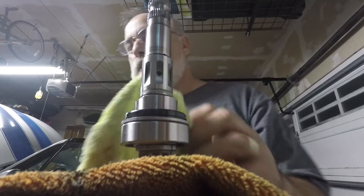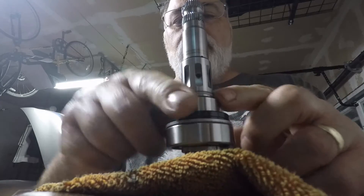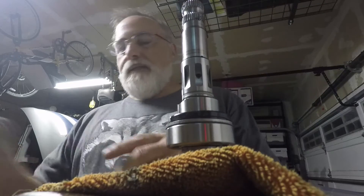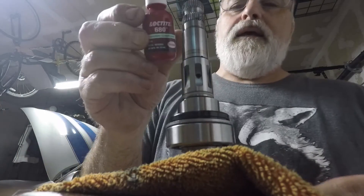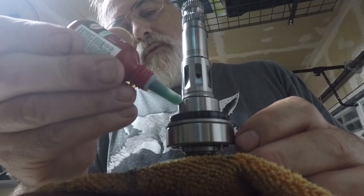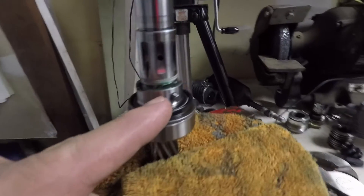So the solution — I'm not going to weld because I don't have a TIG welder, a welder of any kind actually. So I'm going to put Loctite right now inside of this opening here. There's a little bit of opening here, so I'm just going to drip some Loctite. I've got some Loctite 680 — this is a retaining compound Loctite, so it's very strong. I'm just going to pour a little bit. You can see there I have a bead of this stuff, trying to get it to flow down into the channels. I'm going to let this dry and I've got to clean all this stuff up.